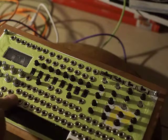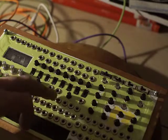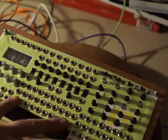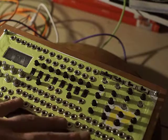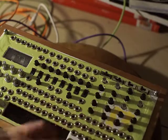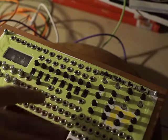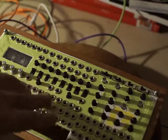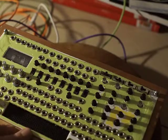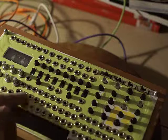And then we have the logic section, which has a divider unit on this 12 central block. Then we have two R2R units on the left-hand side and right side of it. The R2R can be used to attenuate gate signal for the Monotrons, or can be used to remix some LFOs into some strange waveforms that can be used for experimenting. These are also on the patch bay, and we have 4 more R2R on the patch bay.